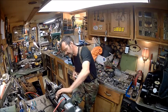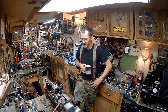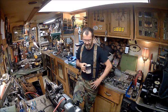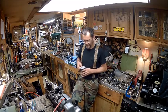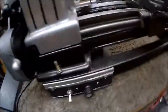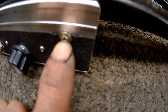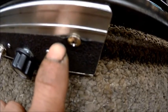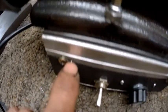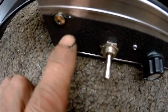I've got oil that was in that chuck when I oiled it — it's slinging everywhere. But this is going to be a nice looking lathe, and it's going to work pretty good we hope. We won't know that until the fat lady starts singing. I do see something here — I see a problem already with this stuff right here. See how it's bubbling up when I tighten that screw down? We may have to cut around that so that the screw is not hitting this part, because that's going to collect shavings. In fact there's already a shaving down inside that one.